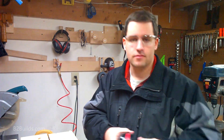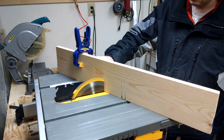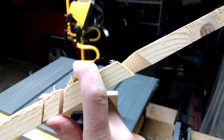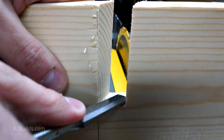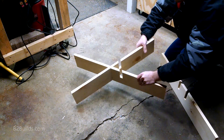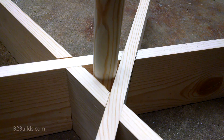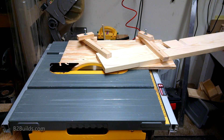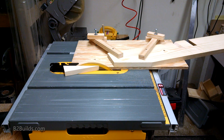It took a little while to get to this point — if I had done the cardboard mockup in the beginning I would have had to redo parts anyway. I got some new pieces marked up and ready to run through the table saw. Once I had it all fit together the way I wanted, I clamped it into my edge joining sled, cut some angles on all of the top corners just to make it look nicer, and smoothed over all the sharp edges with the sander.